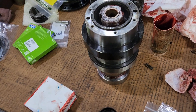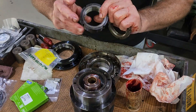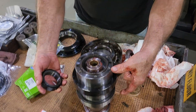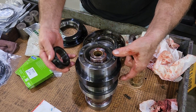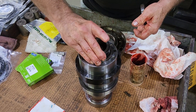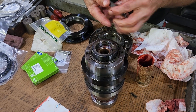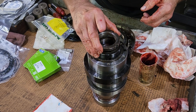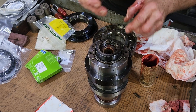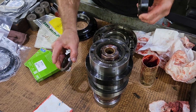Once this is on there, you've got to put the piston assembly in and put this detail on as you're doing it. Then this nut tightens up to a hundred foot-pounds. Then you've got a lock nut in here that gets green Loctite on it. And that's pretty much it — that's how that whole thing comes apart.